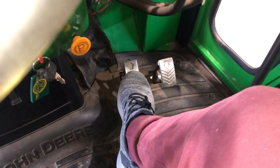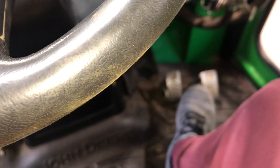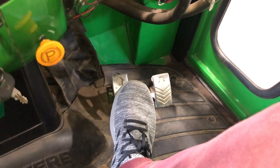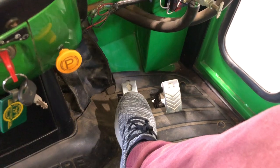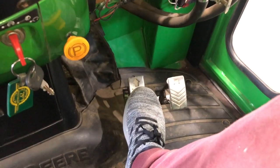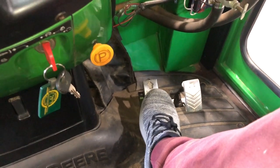There's a variable sensor on this pedal that has anywhere from 0.5 volts to roughly 4.5 volts at full throttle. That voltage goes to the controller to tell it what to do. When there's 0.5 volts on the pedal, the controller says the person doesn't want to go forward, so don't move the machine. That's the neutral position. Press it halfway, and the variable sensor for your forward pedal sends about 2 to 2.5 volts to the controller, telling the forward solenoid to open up about halfway, giving you half throttle.